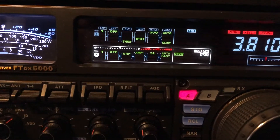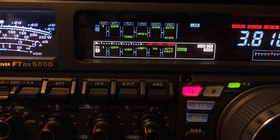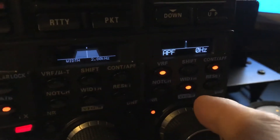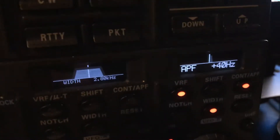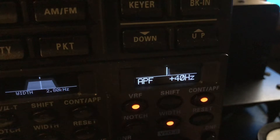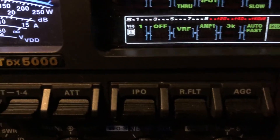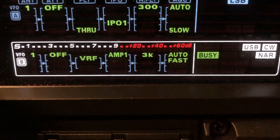You can see how quiet it is when he's not transmitting. There's another weaker signal out there, and he's a little bit off frequency. We can adjust that by going to the APF — he's about 40 hertz high. He's not even moving the meter — there we go, he's got S1. A little QSB going on there.